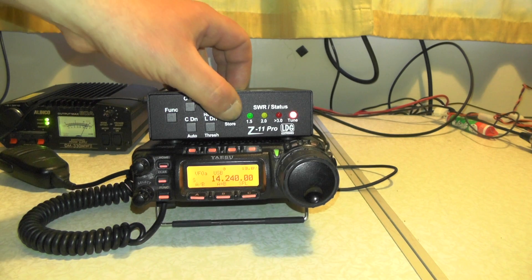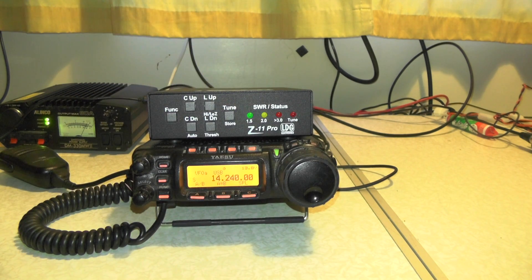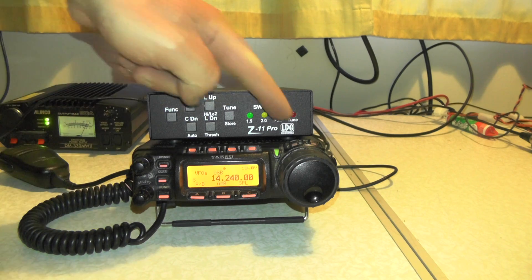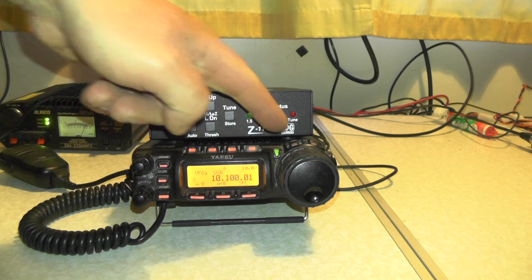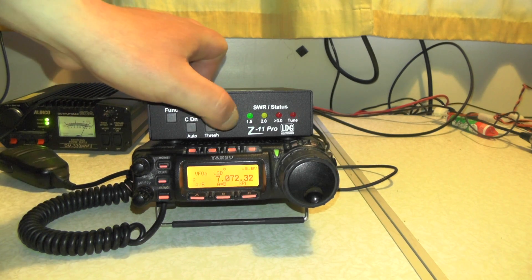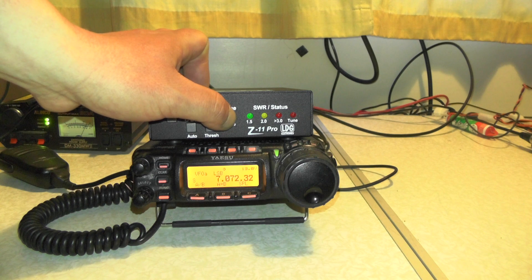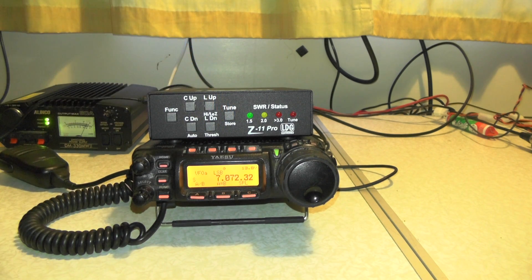Make sure again you see auto-tune so it goes in the middle, and press and hold the tune button. There we go, tuned in. Let's try 7 MHz — that's 40 meters. Press function, tune, make sure it's in the middle, and press and hold the tune button. There we go, that's now tuned in. I'm not going to transmit on it because I'm only using the 11 meter antenna, but you can use it in conjunction with the proper antenna.